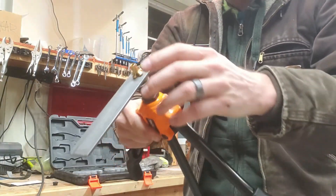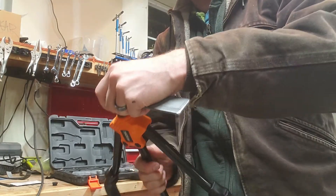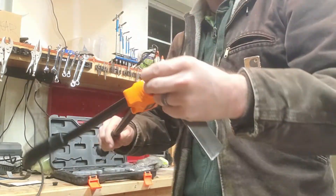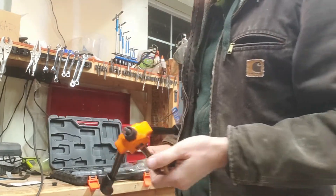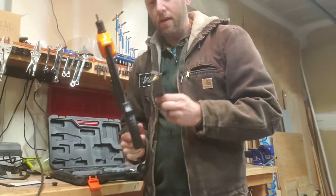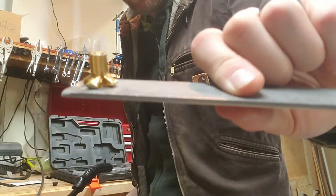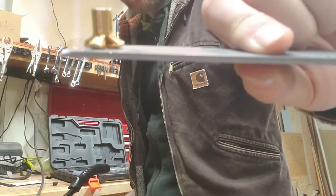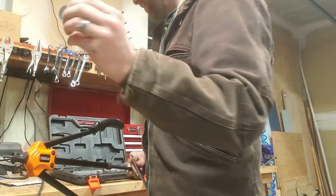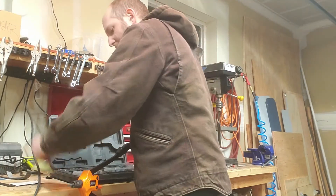I could just keep doing this the same way and tidying it up, but that's not my favorite approach. What I typically do — if I've installed a whole round of PlusNuts — is once I'm done getting them pre-set, you can see this one is in but not fully squished. I don't like finishing it on the three-eighths-inch washer because it warps it, and I can see this one is already a little warped.